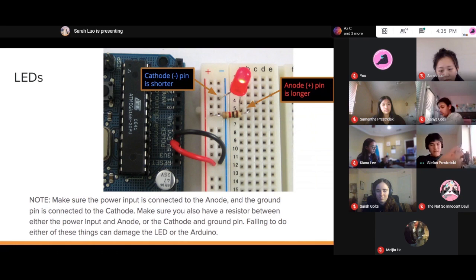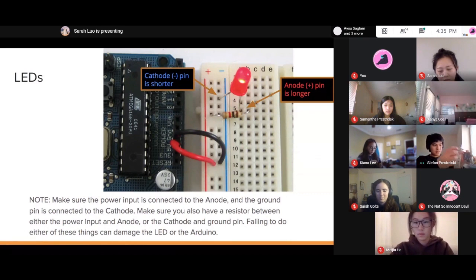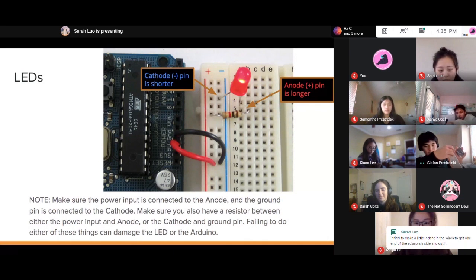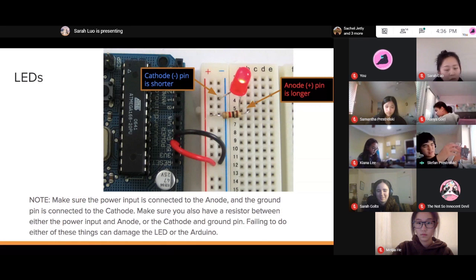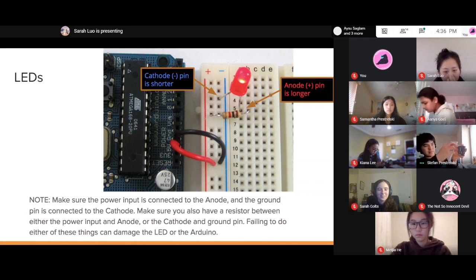Anyways, to answer your question, for example, this wire here I have connected to one of these pins. You can connect it to the 5 volt for this example, and then I have that connected to the breadboard here. Then along this horizontal rail, I have a resistor that goes into this side here. Remember, the electric current won't cross the middle here. And I have that go into the positive pin of the LED.